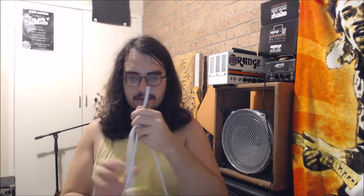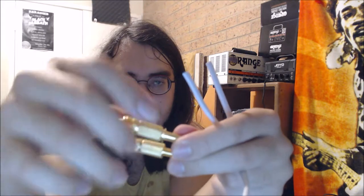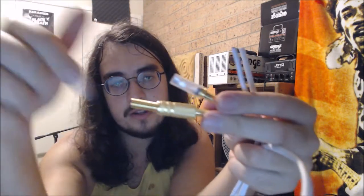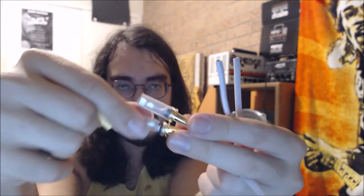What we can do is strip off the ends and clean up the wires. All you need is a couple of quarter inch jacks — I got a whole bag of these for just a couple of dollars off AliExpress, or you can find them on eBay. You'll also need a soldering iron, solder, and a little knife to strip the wire. I'm also going to use some heat shrink tubing to cover the wires once soldered, to protect them and prevent shorts — because that would be bad for your amp.